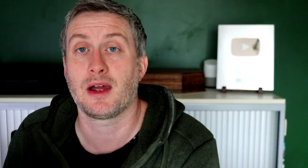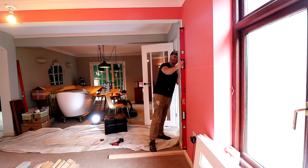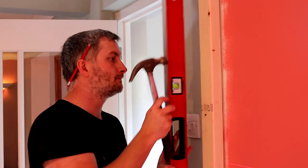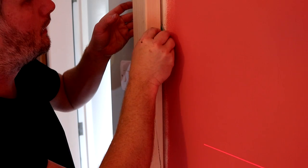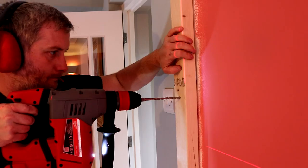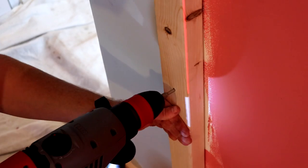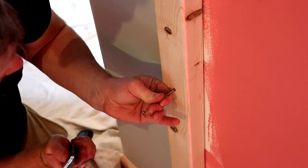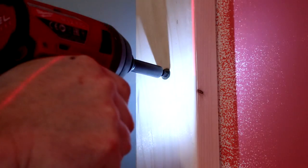I got this one on Amazon — it's pretty cheap and I'll link to it in the description box below. When I offered up a spirit level I found I'd need to shim the wall a bit at the top as the wall the stud was going to be fixed to wasn't plumb. So I'm using some packers here to shim the top out a little bit, then I can use my SDS drill to drill through the wood into the wall, add a raw plug, and then secure with 80mm screws.